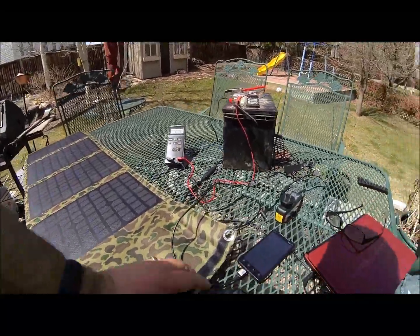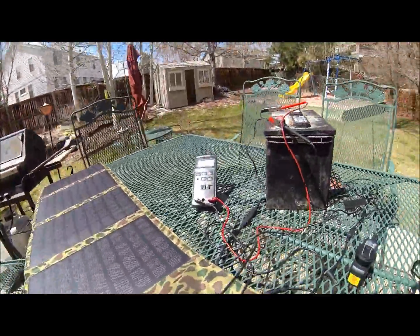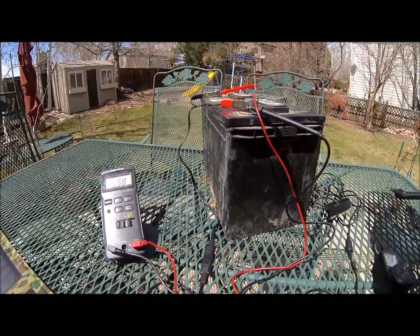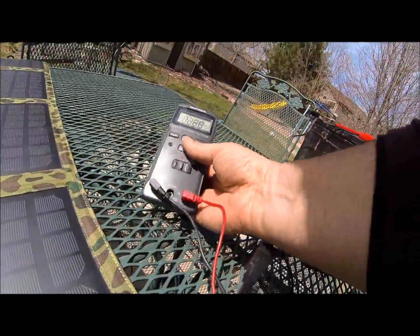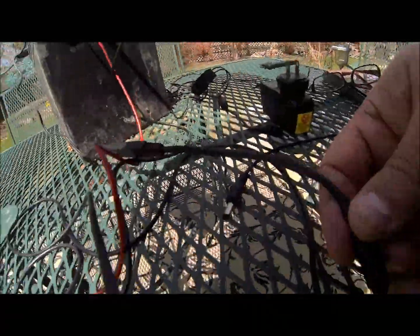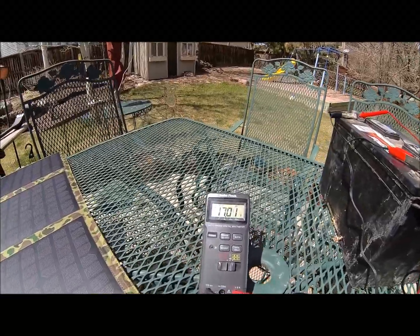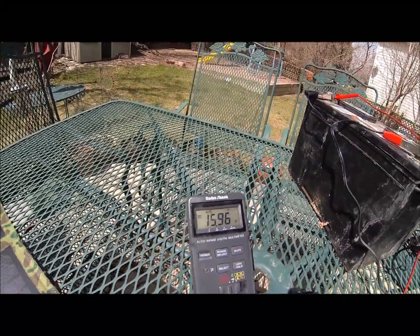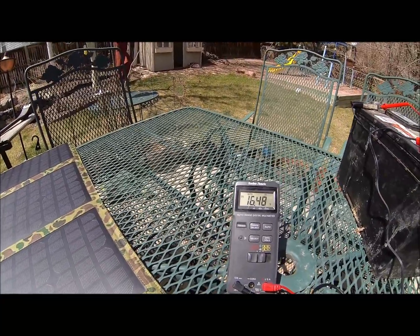My cell phone is still plugged in and charging. We have a nice blue light here showing good sun. The current voltage of the battery is sitting at 12.58 volts. I'm going to plug in the charging cable and we'll see the voltage spike up — it's now in charging mode at around 17 volts. I'll walk in front of the panel and you'll see the voltage drop — see the shade, it just dropped to 15.96 volts. Moving back out of the way, it jumps right back up to almost 17 volts, which is the charging voltage. It's a relatively low amp so it will do a great job of recharging the battery.